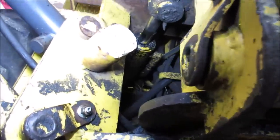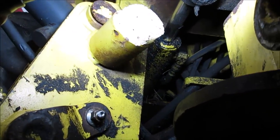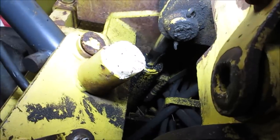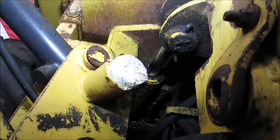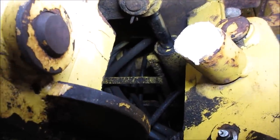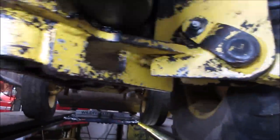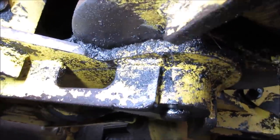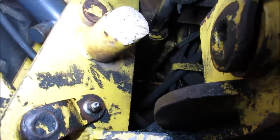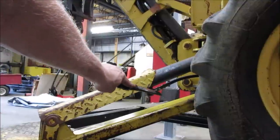So I'm out back here, I'm looking a little bit more. I do see that's one of the swing cylinders, and that is wet on the bottom too. You know, I should probably get a rebuild kit or a couple on hand. It's probably all the same cylinder diameter. That one looks okay. Probably try tightening the packing up a little bit too, but I don't think that's going to do anything. Like just the seal is probably gone. All this wetness over here though is, I think, from when this guy is in the up position running down, it kept that lubricated. All right, so keep an eye on that one. All the other ones look pretty dry though. I know it's going to move in and out of the shop, but we're going to look right there.